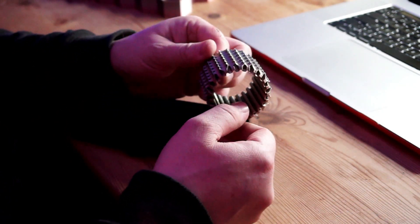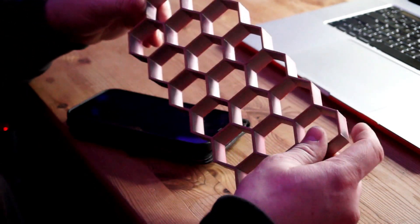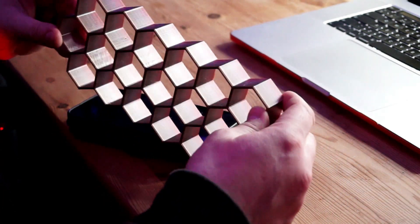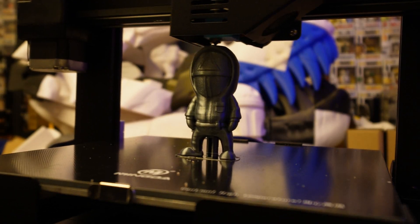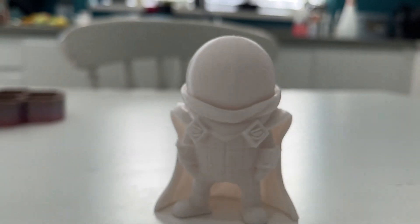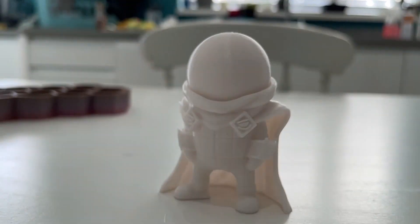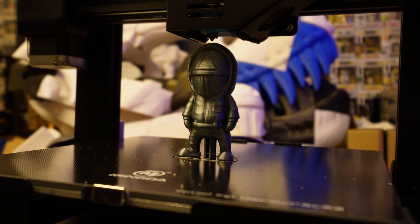In closing, I think that Mingda have done a great job on this printer, competing inside an overbearing marketplace with shipping issues and the world still reeling from the effects of COVID. Along with the vast amount of Ender 3 clones out there, the Magician X gives a refreshing outlook on the evolution of their 3D printing journey. The machine I've been sent has performed very well. However, I would suggest advanced tuning will still be key in areas such as the Cura settings — especially on retraction — PID tuning, and of course E-steps.